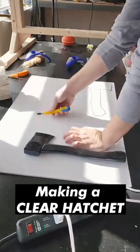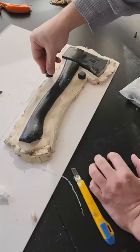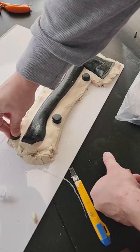The next morning it was time to start molding. You'll notice in this shot the hatchet is actually fully black — this was just a second one I did. For this piece we need to make a two-part mold, so first we're going to surround the entire piece with clay, submerging half the piece in the clay so only half of it gets molded. Then I made some key marks to help with locking.